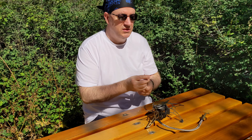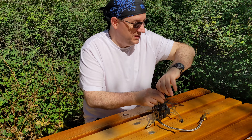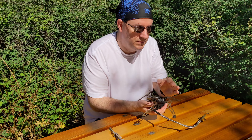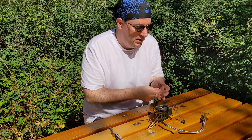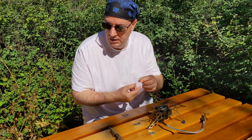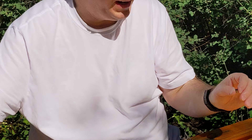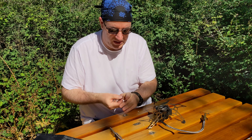This little tool has a wrench on the end. You fit it down inside and just twist — you'll see how easily it twists — and take out your nozzle. So I've taken the nozzle out. You've got to be careful with this. This one is for the naphtha, the white gas, and it's got the smallest pinhole in it.